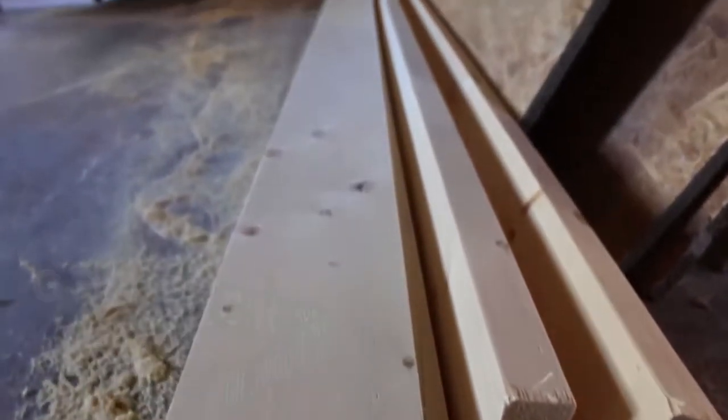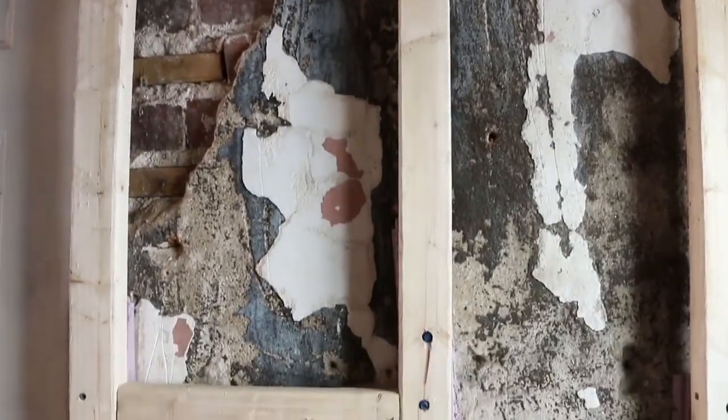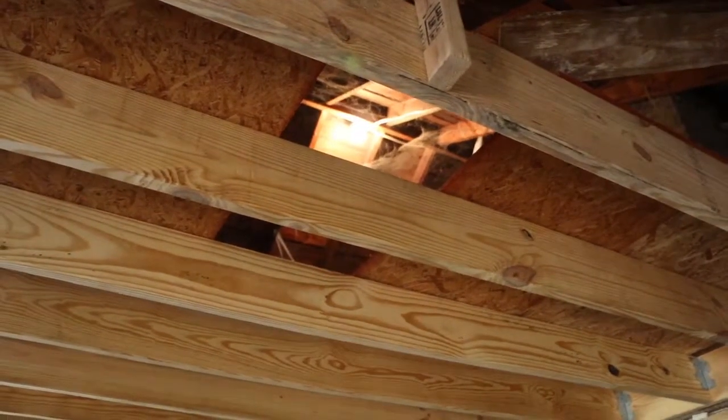As you can see, we are well into construction. Demolition is complete and we're now almost done with framing the home. One thing we discovered was a little bit more moisture damage than we had expected in the floor system, so in the kitchen and some other areas we had to reframe sections of the floor. We've also reframed the ceiling in the living room because there was a very significant sag in it. Behind me over here you can see where we've started framing the new wall system as well.